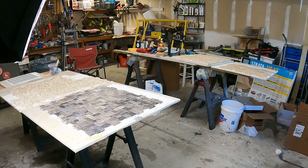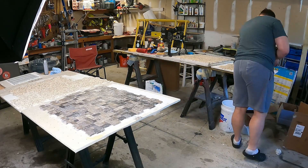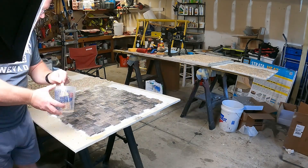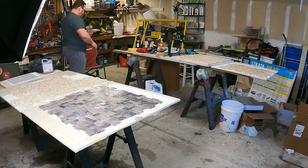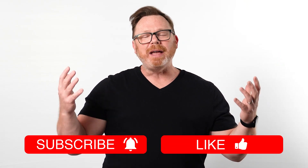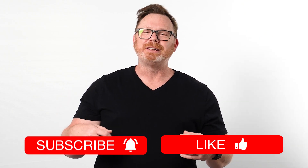This is stone, so the next step is grout release or pre-sealing your tile. No matter what grout you're using, odds are the stones or river rocks or pebbles are porous and will suck up the pigment in your grout. So make sure you're doing a good procedure using grout release or pre-sealing your tile. If you need to know how to do that, I've got a video. If you're getting great information from this, please hit the like button and subscribe to the channel — it doesn't cost anything.